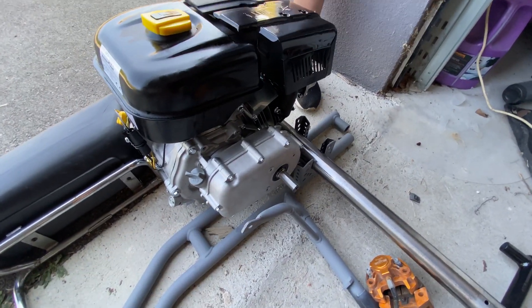Having taken that clutch off, you can see there's a lot more space. But we do need to get the mounting plate at the bottom because it still needs to sit on the engine mount and it's still fairly far out. I need to check if I need an extra plate — a bit of metal I can drill out as an adapter plate to make it fit — but that's given us a bit more space for that shaft.